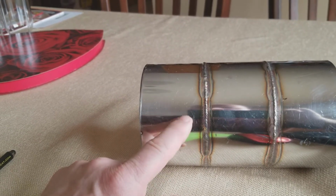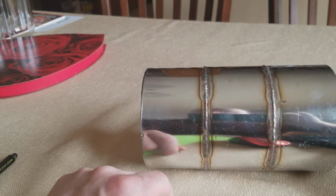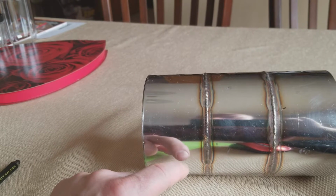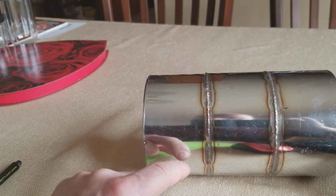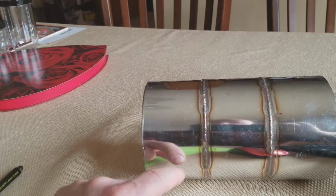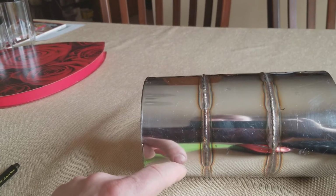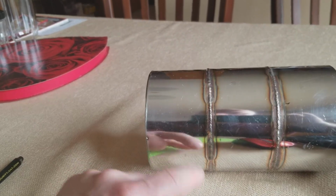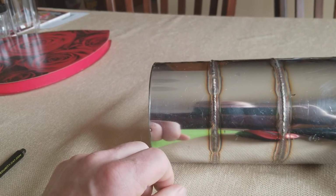You're probably going to find the same thing I did, whereas the Z is slightly different. And if you really want this profile to turn out nice, you'll definitely go through each point and don't just go until the paper touches. Pull the paper out if you're using paper, and definitely turn the cutter until you see a light chip.